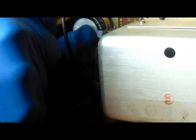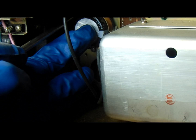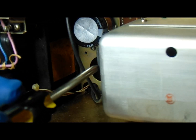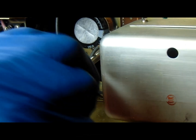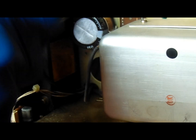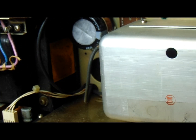I'm really sorry — I had started this video right from the very beginning with the covers already off, but I accidentally deleted it. The main thing I pointed out before getting started: you definitely need to build or buy a capacitor discharge tool and discharge all the high voltage out of this rig or any other hybrid or tube-type radio. The TS820 has 800–900 volts in there, which can certainly kill you.